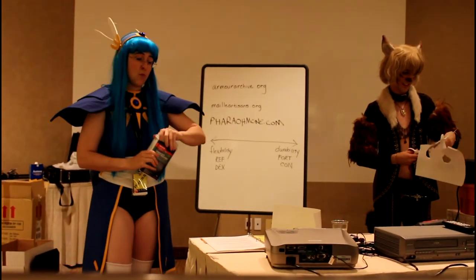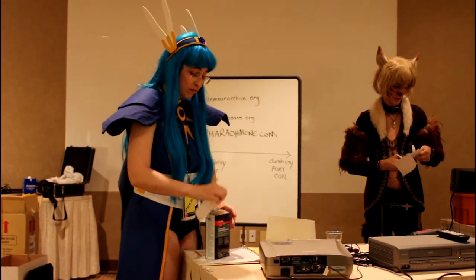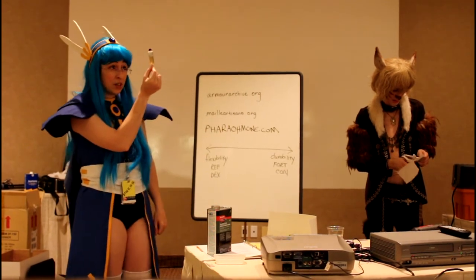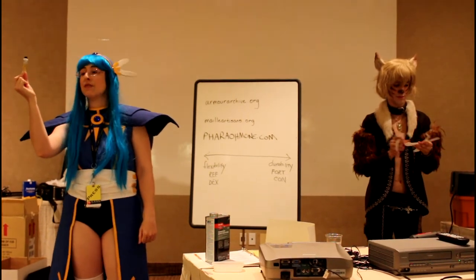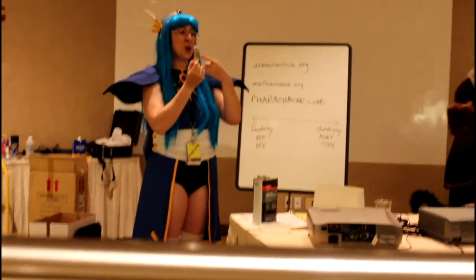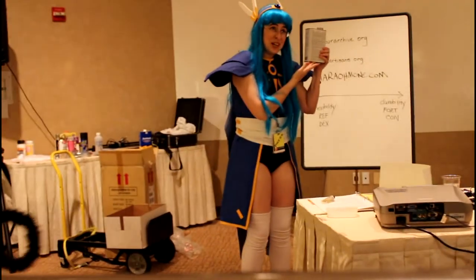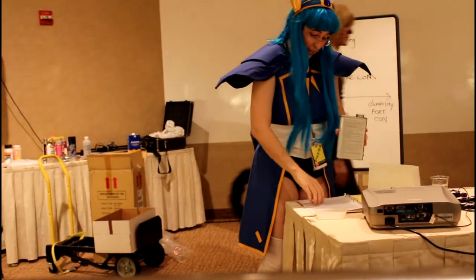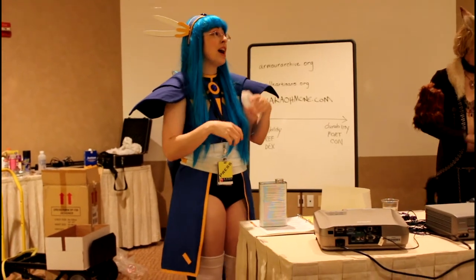And you mix it with a hardener. This is basically what they call a two-part resin, which means you have to mix part A and part B to get your final result. This is hardener, this tiny itty-bitty little thing, because you only use it in drops compared to literally cups of fiberglass resin. It does not take very much of this. This is what makes it cure. So use it according to the directions on the can, because they tell you exactly how many drops of hardener to use with the resin. It can be a good investment to purchase a medical scale so that you can actually weigh it. Or you can have a measuring cup.